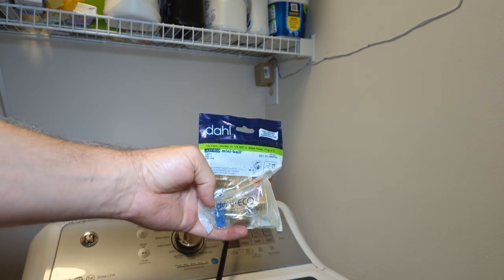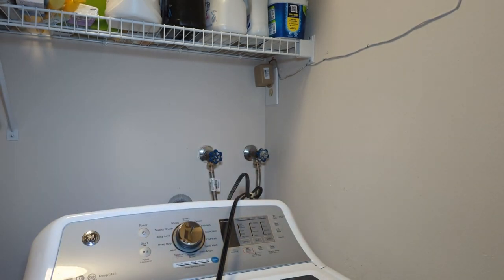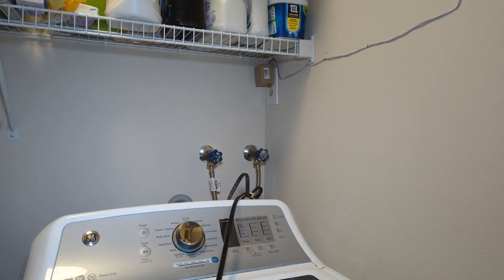These are a Dahl brand. I'll try and leave a link in the description if I can find them. They're quarter turn ball valves. So all we need to do, we'll get this washing machine out of the way, pull it out. We'll unhook those two hoses. We'll use a torch. We'll unsweat those valves, yank them off, clean them off, and sweat these new valves on.